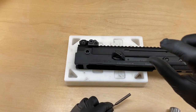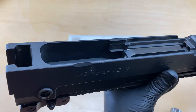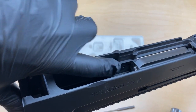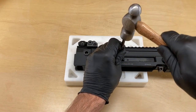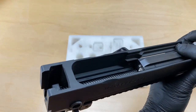The process now is to slowly drive the pin lower and lower into the receiver until you can see it through the bore — the hole inside the upper receiver — and stop before it comes into the bolt channel.